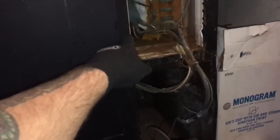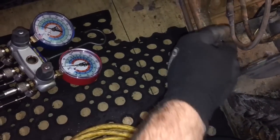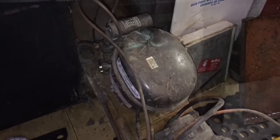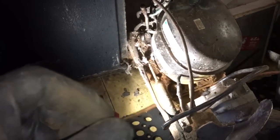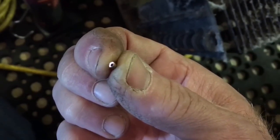Charge recovered and I cut the insulation off. Look what I found — it's three-eighths suction, and then somebody went hocus pocus with a quarter inch. No wonder it's dead. That's the OEM cap tube. This is an old R12 system from back in the day. We'll cut this out and take a look. I know it's plugged, but I'm going to show it to you anyways. I'll cut a piece off and put it up to the lights — totally plugged. Nothing. Just plugged.